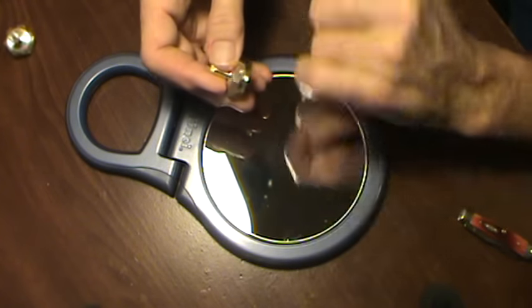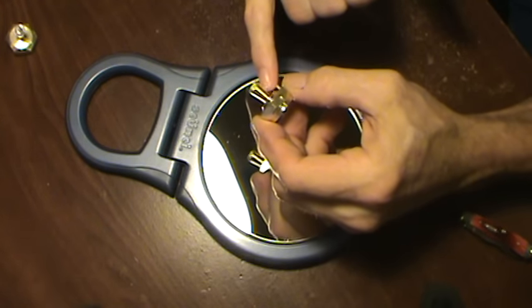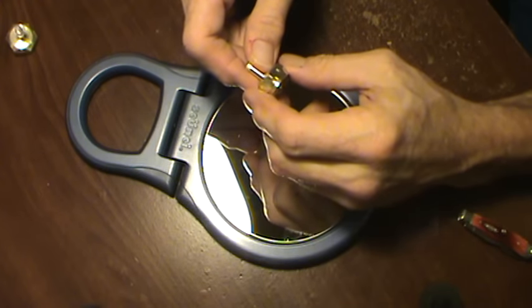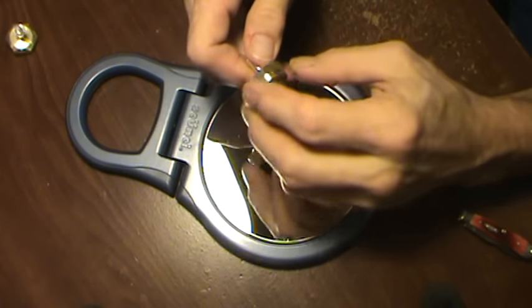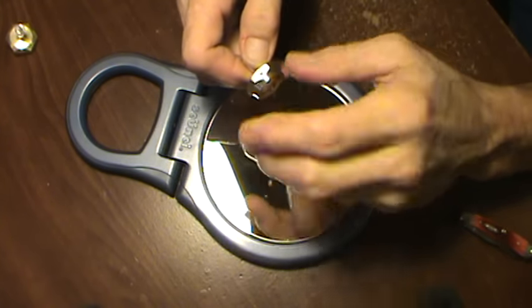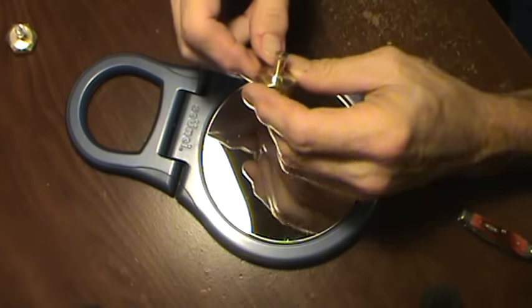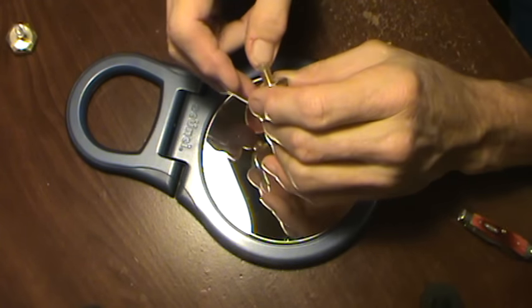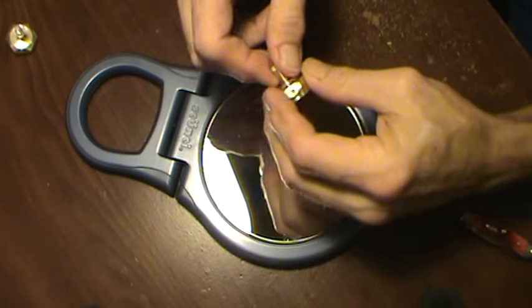Now this one's slightly out of balance, and the reason is, I don't know if you can see that ding right there. I got a little overzealous, taking a little bit too much out of that taper, and it came dislodged from the jaws in my lathe. So then I thought, well, I'll just take a file and flatten all these off. Well, when I did, I removed too much material here, and I had already planned on cleaning the flat sides off. So not a big deal. But just that tiniest little bit, I have a small wobble in this, but I still get 4 minutes out of it. So I'm hoping after I clean the rest of this up, and take a little bit more weight out of it, I might even be able to get this 4-minute top up to 5 minutes.